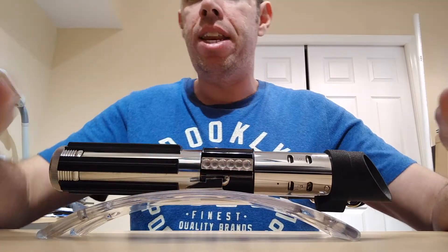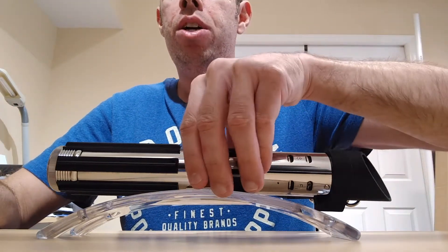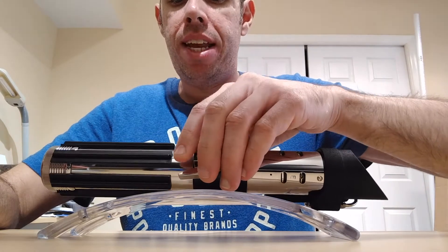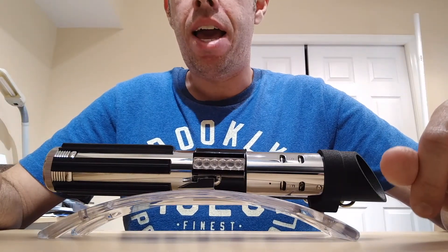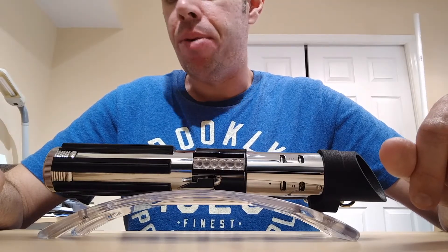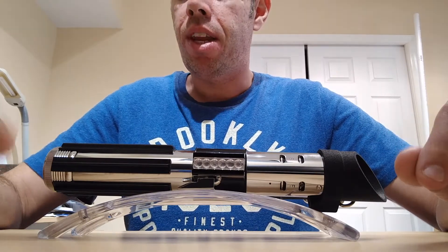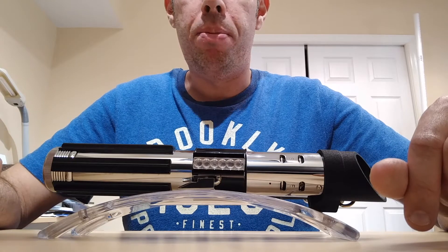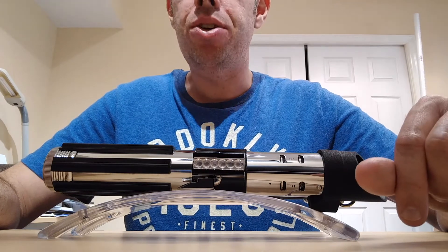I have a Nano Biscotti version 3 for the sound card in here, and a 28mm 2W bass speaker which sounds amazing. That is all run off of one 18650 Li-ion battery, which works out pretty cool — I haven't had to charge it yet and I mess around with it here and there. As far as the chassis goes, I made that myself out of PVC; everything fits all nice and snug in there. I also have a recharge port built into the chassis, which is pretty cool.